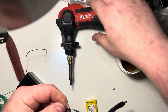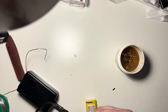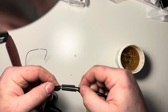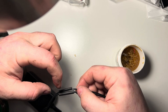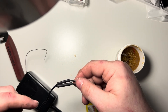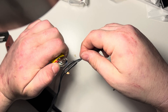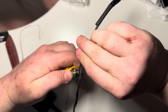I'm going to turn the soldering iron off before the smoke alarm goes on. Once they've cooled down, you'll move the small sections of heat shrink over your solder joints. An advanced method would be to stagger where the joints are — cut one side shorter on this end and then this side is shorter on that end. But as long as you're using high quality heat shrink and you're not leaving any jagged edges, you're fine. So we'll apply heat to melt these, and rotate.